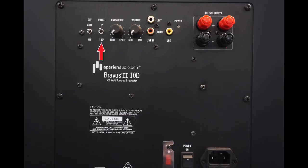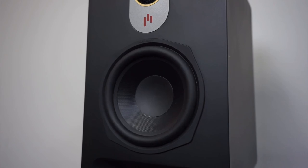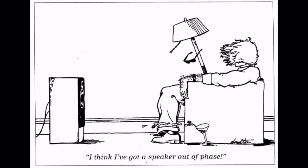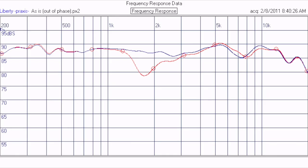Finally, we'll cover the phase adjustment. This step is a little trickier than the other parts, and there are many measurement systems out there if you live for perfection. Phase refers to the movement of the actual woofer itself compared to the other speakers in the system. When a speaker receives signal, the woofer cone moves in and out, and the goal is to have all the drivers in the system moving in the same direction at the same time. If the cone on the main speakers are pushing out while the subwoofer's cone is pulling in, they will cancel each other out, leaving you with a very weak bass response. Obtaining the phase curves for the subwoofer and main speakers can help you determine how they will work together.